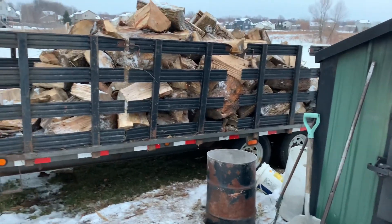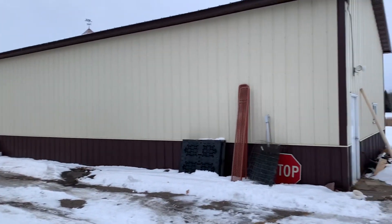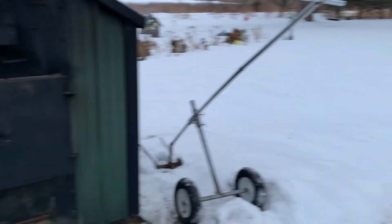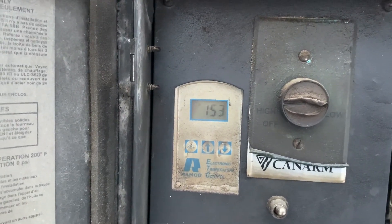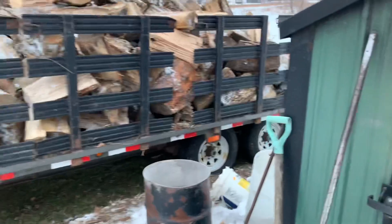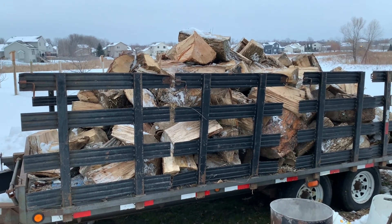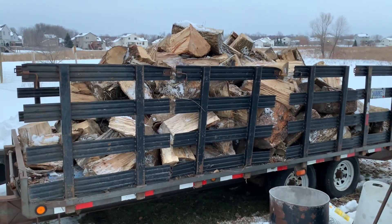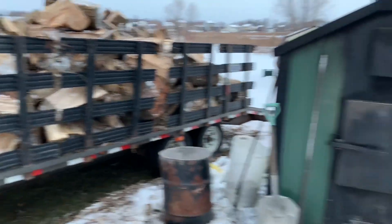Well, that's our little overview. You can save a lot of money heating with wood if you're willing to do the work, because I don't know what it would take to run the in-floor in that shop on gas, or this shop, or the house. This runs at around 150 to 165 — kind of a trip-and-reset deadband — it'll run up to 165, trip off, then drop down to 150 on the fan box. In weather in the 20s and teens it's more mild, but if we have a big snap of sustained 10-below cold weather, he's burnt up as much as a trailer of that in eight days in a real bad cold snap.